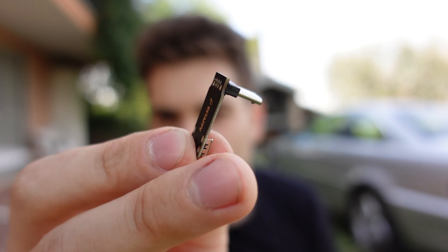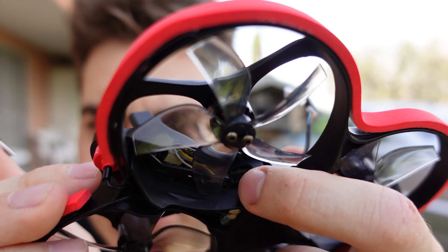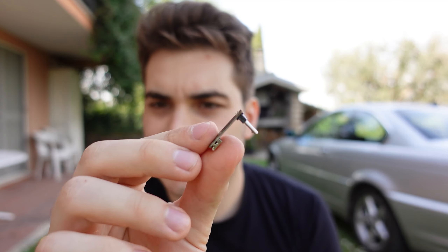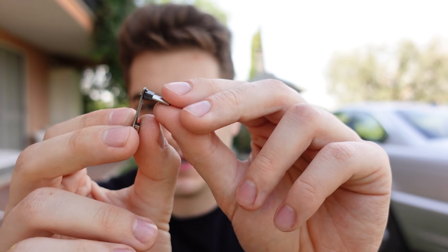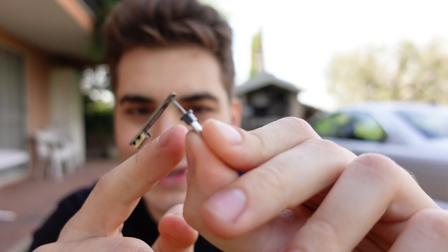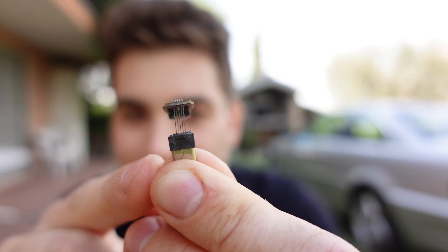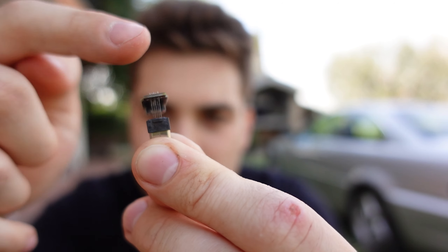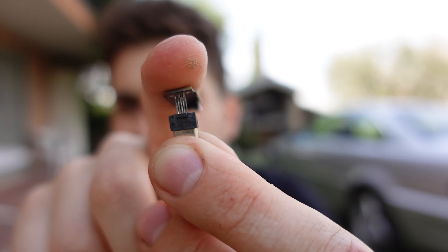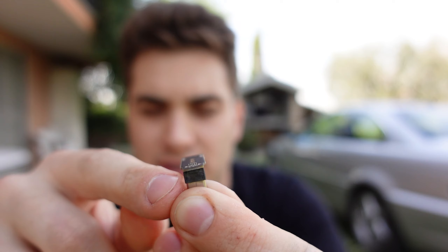They also give you an angle connector to plug into Betaflight, since the flight controller is hidden down there. But this connector has a huge issue: when you pull it out, the connector gets stuck inside and all the wires come out — it's a mess. They didn't solder it to the board. I actually fixed mine and I'm going to put some glue on it. I don't know if it's just my unit, but be really, really careful with it.